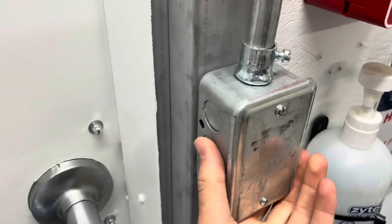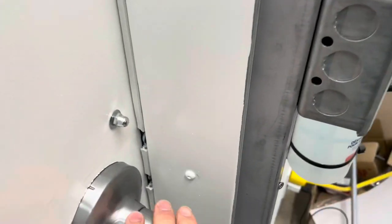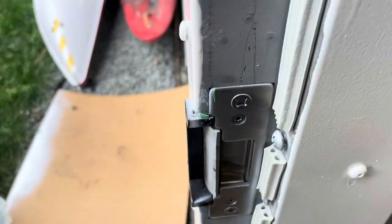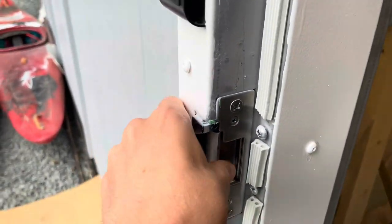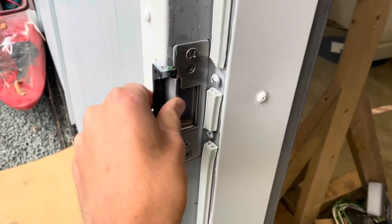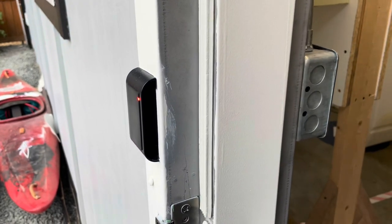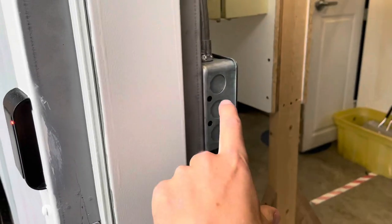I've minimized one of my boxes here — now I've just got one box which goes down both ways. One goes down to the electronic strike plate in here, which by the way is really strong being attached to the steel frame — there's no way that's coming out. And then the access control reader is right there, so just the one box now.